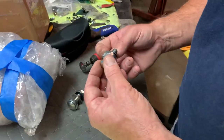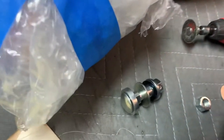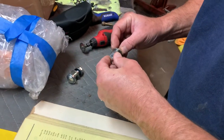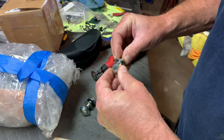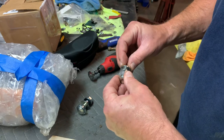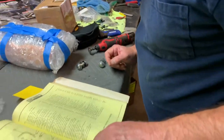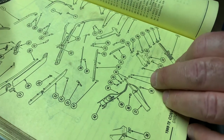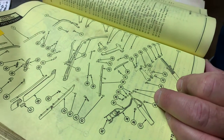I assume that little piece provides some cushion. The way they shipped the assembly would be the way it goes together — logic would dictate that. But we've learned already that logic does not exist. What this does is when you tighten down on this nut, it spring-loads it instead of putting all the pressure on the casting, and that's how they keep them from breaking. The spring washer does not show in the manual — it just says carriage bolt, washer, and bushing.